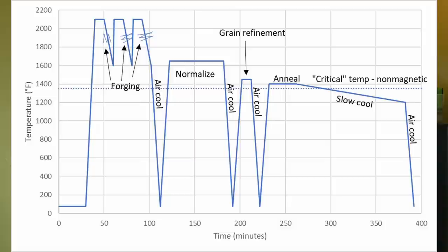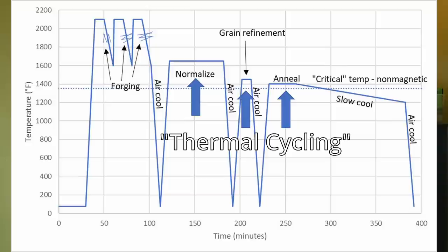For forging bladesmiths, the first step is forging. Don't forge the steel too hot — a general temperature maximum for forging low alloy steels is 2100°F (1150°C), though some data sheets recommend lower such as 1925°F (1050°C). Lower temperatures minimize decarburization and grain growth but give a narrower temperature range to forge in. After forging, you perform heat treating steps to get the steel ready for drilling, cutting, grinding, and the final hardening steps including austenitizing, quenching, and tempering — sometimes generically referred to as thermal cycling.